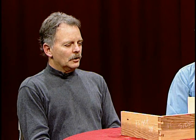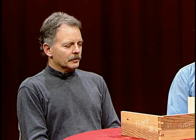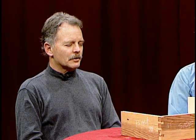It just depends on how much time and effort you want to put into that drawer, and the application. Is it a bathroom vanity that you're knocking together that may or may not be around 15 years later, even though yours is? Or is it something you're going to sell to a client that's going to be passed down? I think a lot of it was also driven by older furniture, where mechanical slides weren't even available. Then you get into sticking drawers, where you're tugging pretty hard to get a drawer open, and you need better joinery to hold that drawer box together. But with the advent of modern ball bearing guides and the like, it's much lesser of an issue.